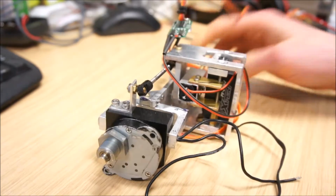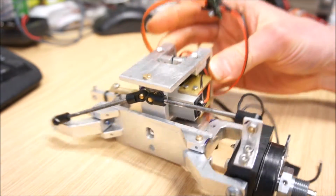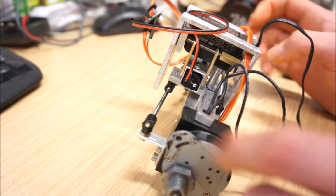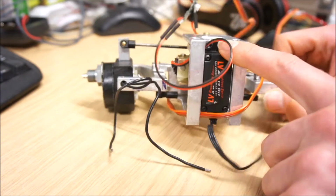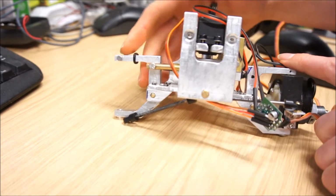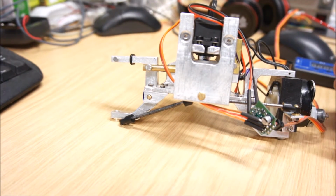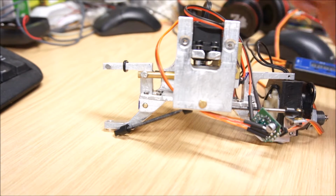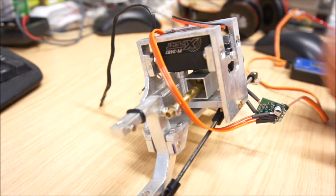So as you might remember from my previous videos, the front axle of the Grader is quite complicated because it has three functions: the front wheel drive, the steering obviously, and the wheel lean, so that the two wheels can tilt either that way or that way to act against the moldboard, adding a sideways force on the grader. So yeah, that's the new version.